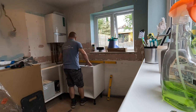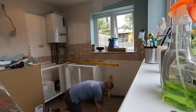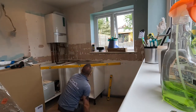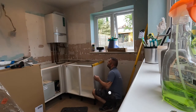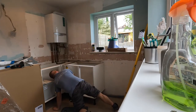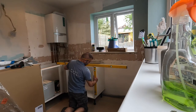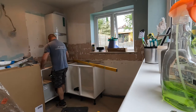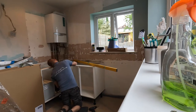I was once in a situation where I had to remove a 500 base unit for a plumber who needed access behind it. The unit had been secured to another unit at the back where you couldn't reach it, and a granite worktop was stuck down with silicone — so I ended up taking that unit out in probably 20 pieces. Luckily it was a standard unit available off the shelf. Always put screws where you can reach them — no one will notice an extra screw hole inside the cupboard.